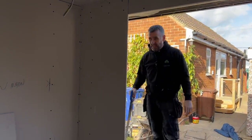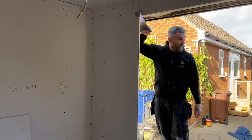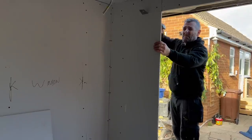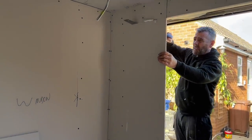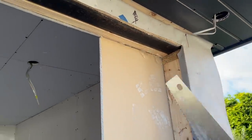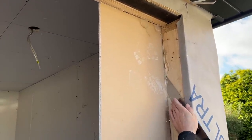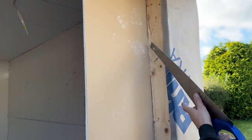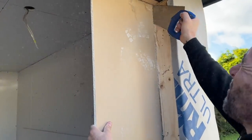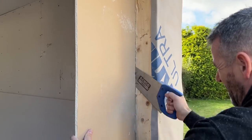I've put this piece of board in — it's too big. I'd normally reach for the multi-tool but I'm cutting this by hand. Plasterboard dust really burns in your eyes so wear eye protection — it's really windy today so no matter where I stand it'll blow in my face. The top's easy enough following the line, but I need to get through this part. I rub the saw backwards and forwards on the edge until it goes through, then just turn it upside down, using the timber as a guide. It doesn't matter if it's a bit rough because you'll put your door in and the architrave will go over that.